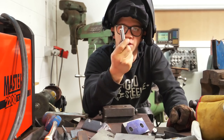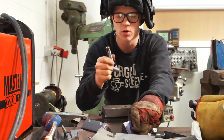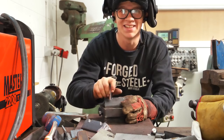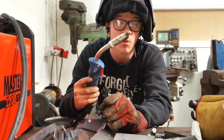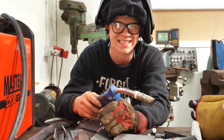I've got all these pegs turned down and I've ground a little chamfer on them — they all fit in here. We're now going to weld from the top, nice and heavy, in all of these while it's held in the die that will go in the power hammer. I'm going to use the MIG welder because I can lay down a lot more filler material and get more penetration. I think that's appropriate — let's do this.